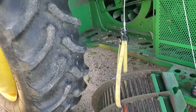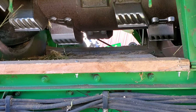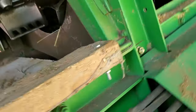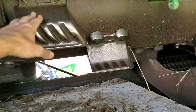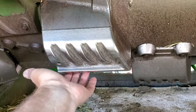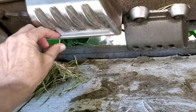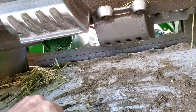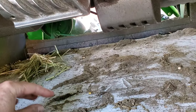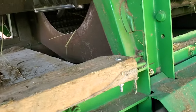What I ended up doing is just awkward because you've got to get them up and bolted to the underside of that rotor. For those who don't know, the concaves sit up in here and this rotor spins — it's disengaged now, but it spins 300 to 800 RPMs. The concaves are cupped in this orientation and get bolted up on a plate, and then cupped on the other side. That distance between the rasp bar and the concave is where the grain spins around, rubbing up against the concave, and then the grain falls out. In this case it was peas — everything else falls out too, but it's basically threshed, and then it's just a matter of sorting out the peas you want to keep. Everything else gets sieved and blown out the back of the combine.